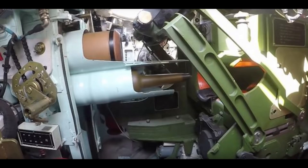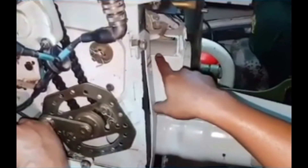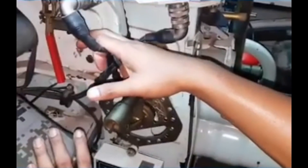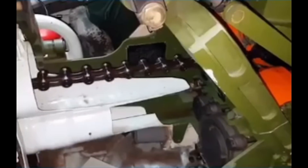Since the charge is located above the projectile, he turns the handle again to lower the charge to the loading position, unhinges it, and pushes it until it's halfway into the breech, then grabs the ram and pushes until the breech is closed. The gunner then gets a notification on his side that the gun is loaded and can proceed with firing. That would be the semi-automatic procedure.